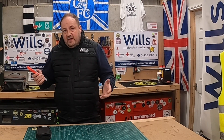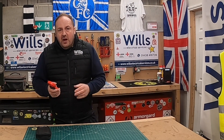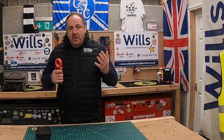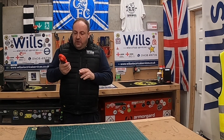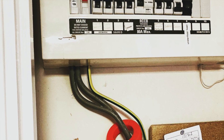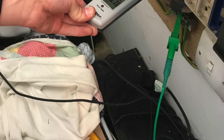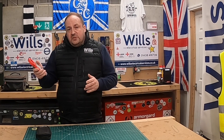I know there are a lot of people who don't like split-load consumer units, but they're very cost effective, especially on rental properties where we have to be competitive. If we've measured the leakage, I'm more than comfortable to do that. Obviously in some places like HMOs or really big houses, it would wipe out a lot of circuits and we certainly wouldn't do it. But as long as the bonding's up to size and it hasn't got a borrowed neutral, you can easily just use this to make that call.